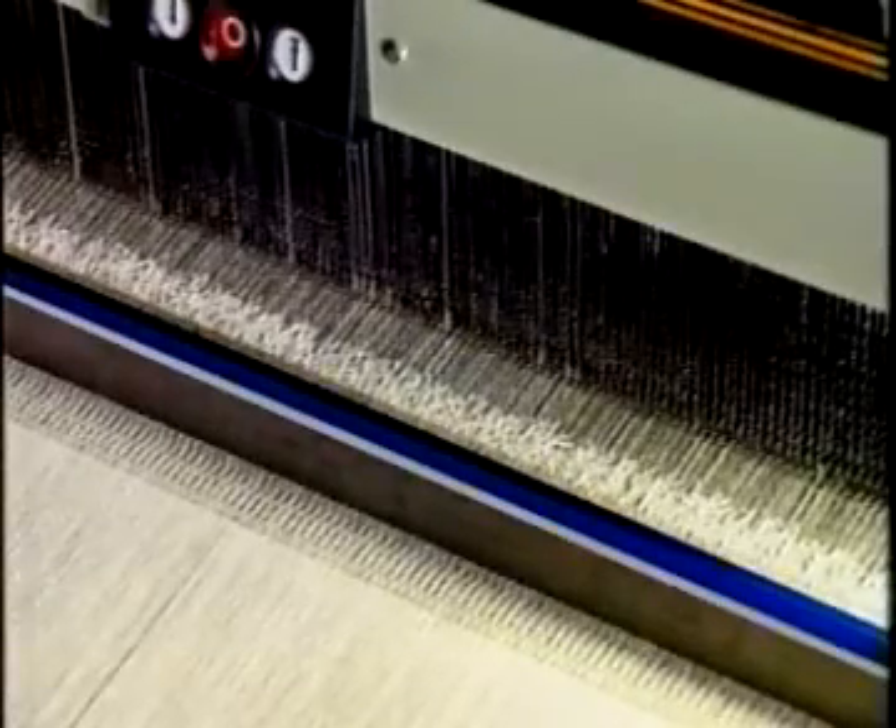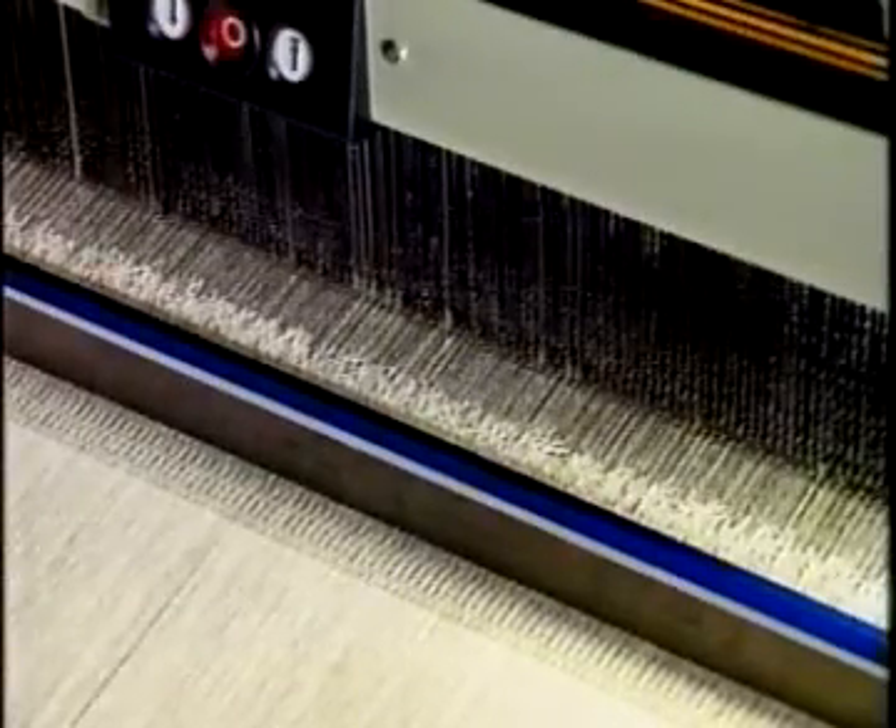If the new warp is going to produce the same fabric woven on the loom, the new warp ends can be knotted with the existing warp ends by a tying machine. Then the new warps are drawn through the droppers, heald wires, and the reed to start weaving.